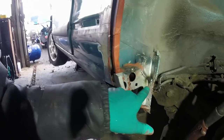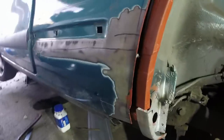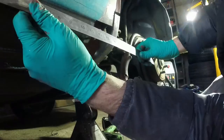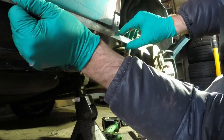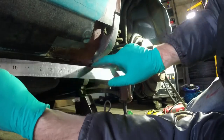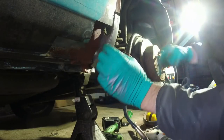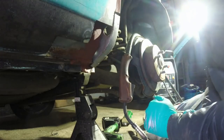I've got a couple of heavy tacks in here and here and then I've moved this back to where I need it. You might think that's a big stupid gap there and it is quite a big gap, but it's necessary — well, it may seem to have packed too much off before, but it's going to stay like that. The reason being, I've found my straight edge and now I can check and make sure the clearance I need between this panel and the rear wing is about a mil. I can hammer this out to make that. Then this body line running through here — that's about right, that one's about right too. So I'm happy all of that's going to be in and about the right place, particularly that bit which is kind of the most crucial bit. This is in free air so I can move it in or out as I need to later on. So now I'm happy that that is where it needs to be — I can actually weld it up.